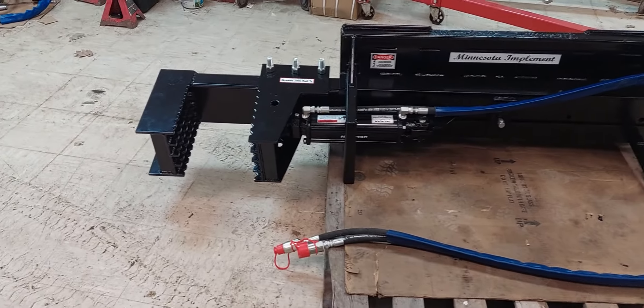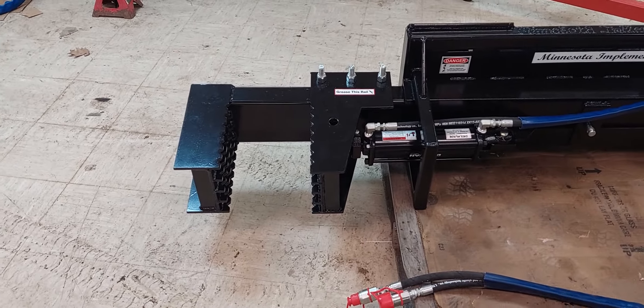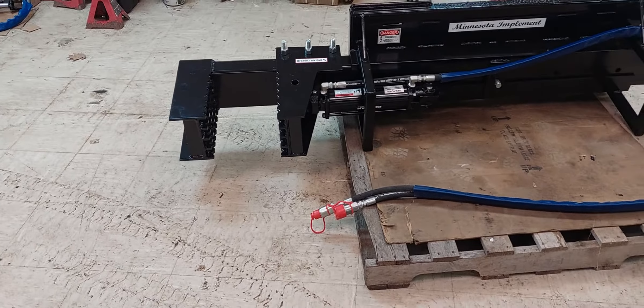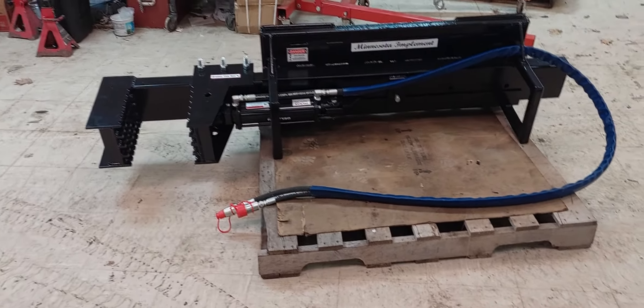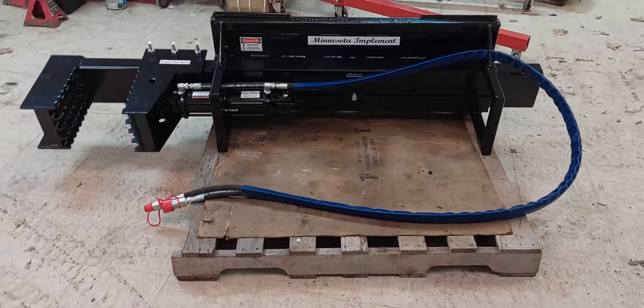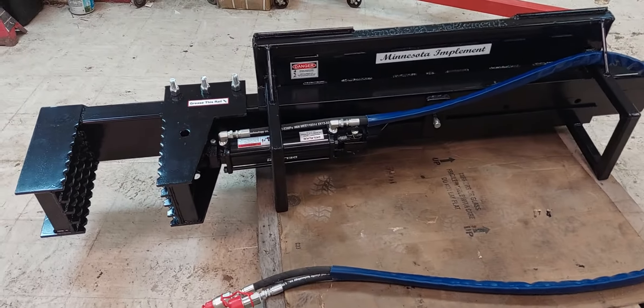They could grab the post at five or six feet up and then lift their boom as they tip back — grabbing the post in the middle rather than by the very end. Because if the puller was directly in front of the machine, you'd be straddling the end of the post and have a hard time getting any depth without the post being lodged under the machine.